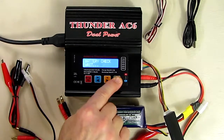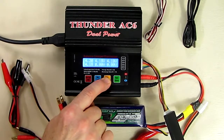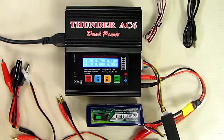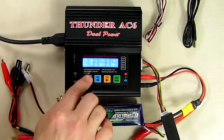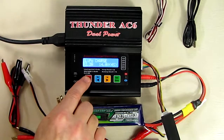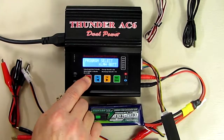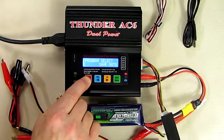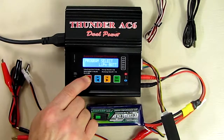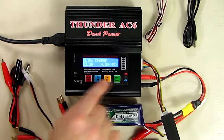That's a balance charge. If I wanted to do a LiPo charge without balancing, I'd use the same menu and same process — it checks the battery and charges right through the main port — but I wouldn't recommend that. Balance charging is best. Going back to the menu, you can go through program select for LiPo, nickel metal hydride, NiCad, and lead acid battery types, save or load data using the cable.